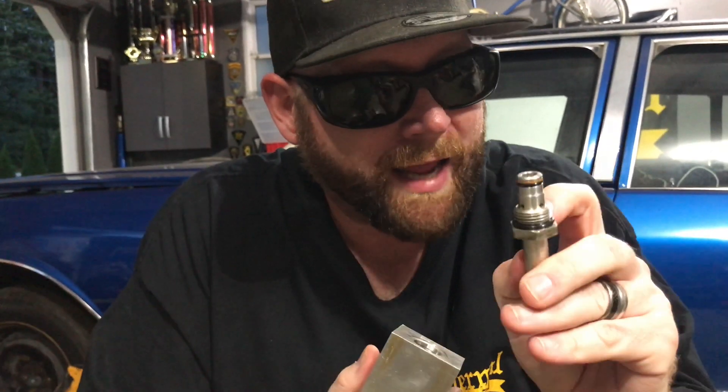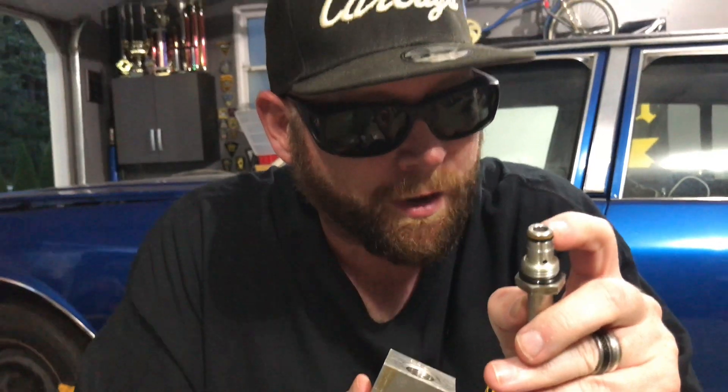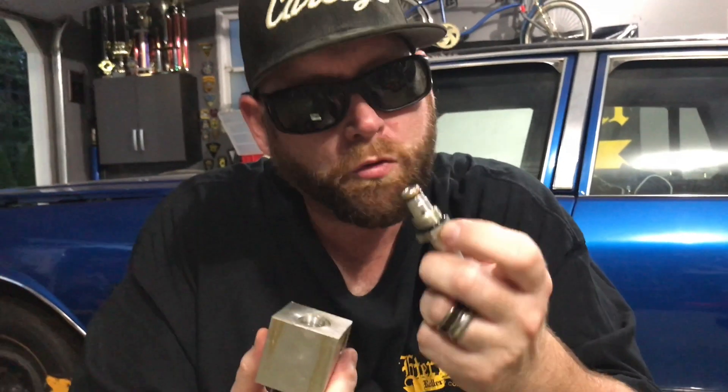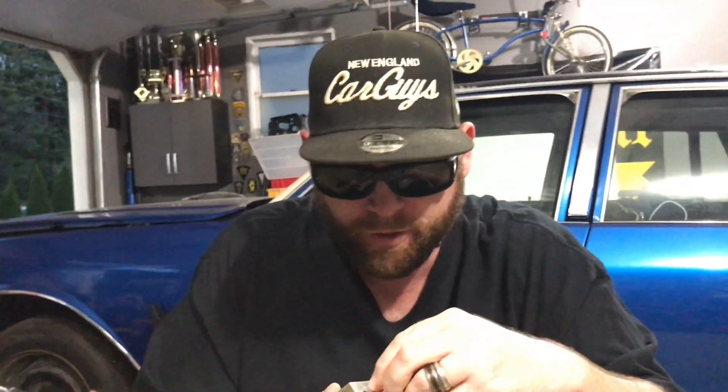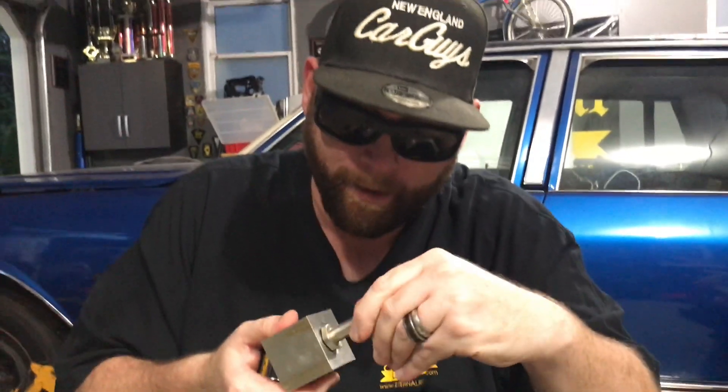Just so you can see — here's the entire cartridge, and it has a neoprene ring on it, also a backup ring and another neoprene ring. The most common problem with these is that the neoprene ring will blow out, and a lot of times you'll see it kind of blown out around this particular nut.